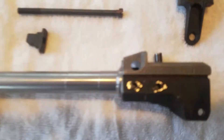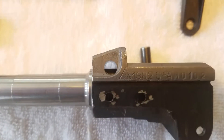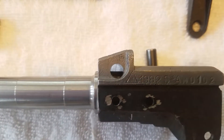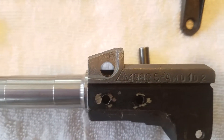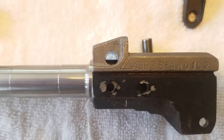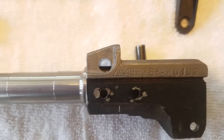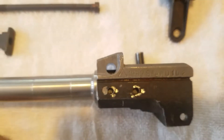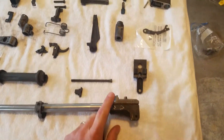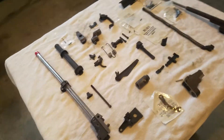Probably tomorrow. You can kind of see — let me zoom in — the new barrel where the trunnion hole is. I've got a quarter-inch end mill bit for that, brand new and sharp — it's a Kodiak. If you're gonna do this, make sure you get really sharp bits. I also have a seven-millimeter honing bit made by Yankee Corporation. Really good stuff. It was like 50 bucks for those two bits — not cheap, but you don't want to screw that up because this is probably the most crucial part of this build for structural integrity.